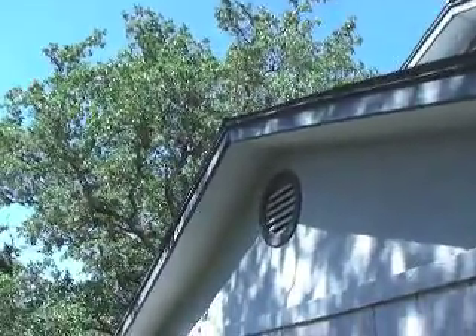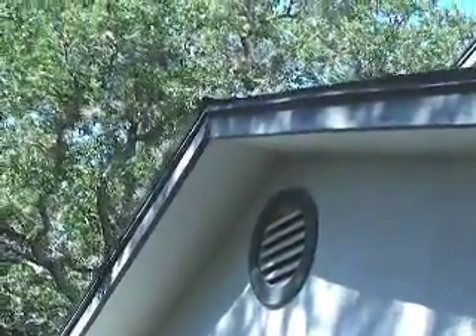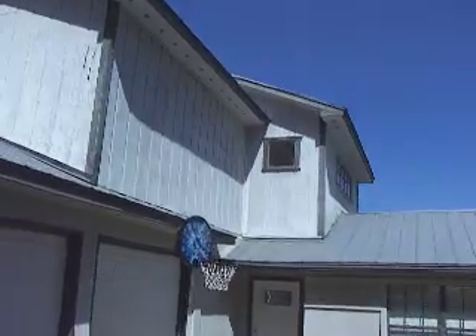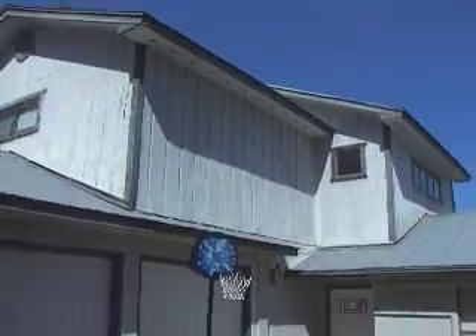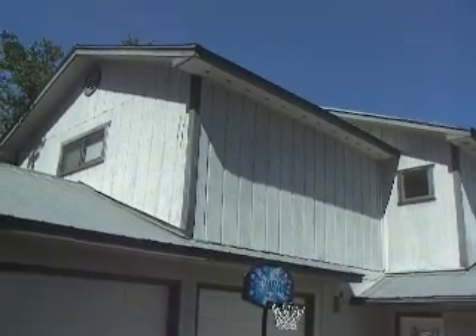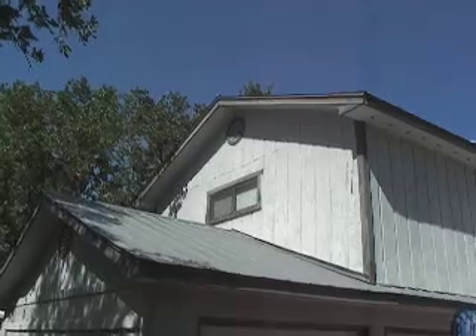There are areas that Mr. Burland had concerns about regarding how we're going to make our repairs. We'll cut back to the rafters, straighten it up, and then do our fascia overlay — making necessary repairs whether it be rot or small spots in the joints. We also have round gable vents in the front, and Kenny, I haven't got the measurements on those so we'll need to get those.